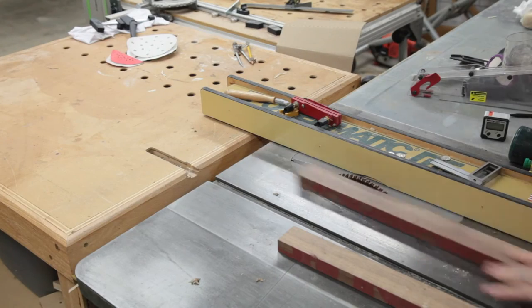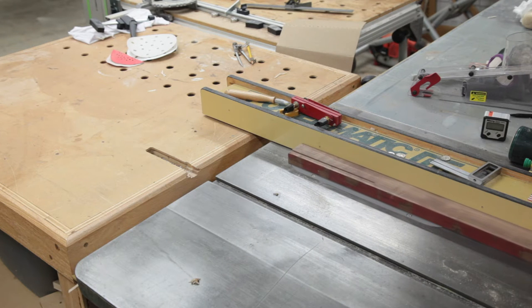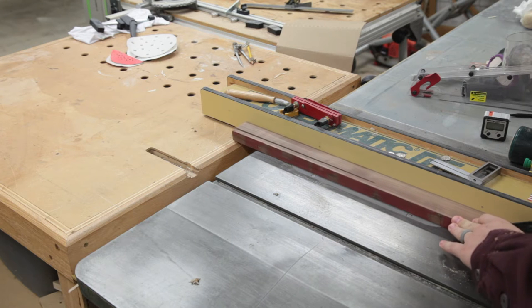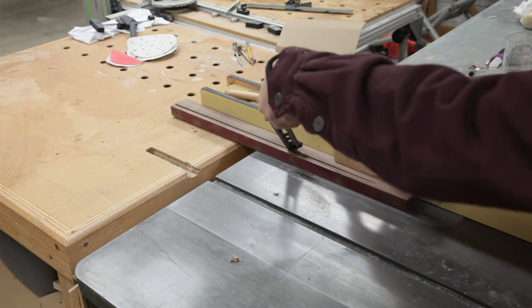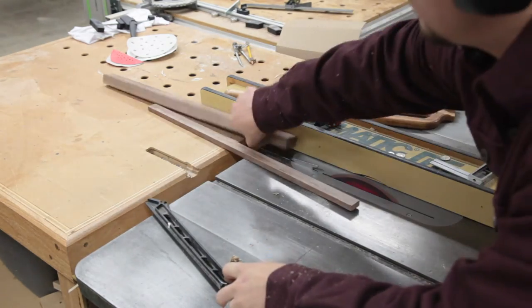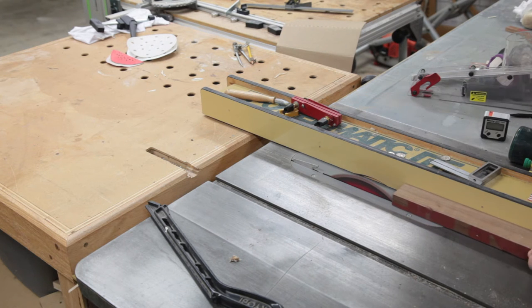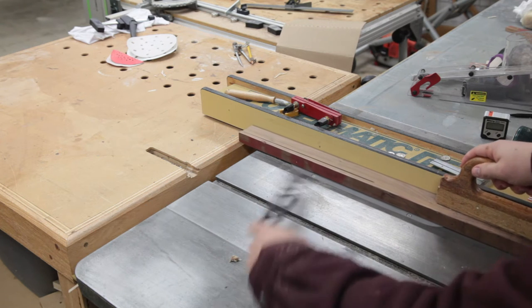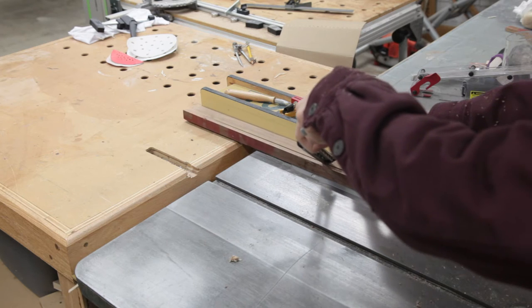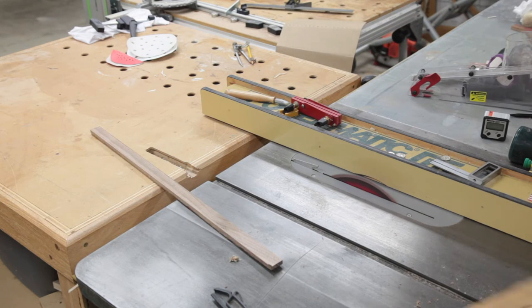These pieces had a really clean cut on one end, so I'm just going to run the flat end against the fence and then cut the other side square. This ended up being an inch and a quarter. My stock is a little over three-quarters of an inch — it's definitely closer to a four-quarter thickness, which is nice because it gives you some stability on the base while you have the cards propped up. Since I don't have a full-height splitter in here, I'm just using that other push stick to make sure everything stays tight against the fence. Now it's time to plane the boards.